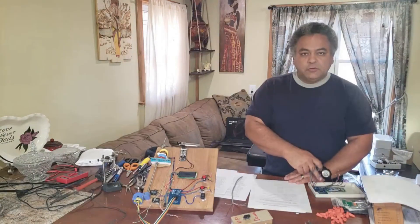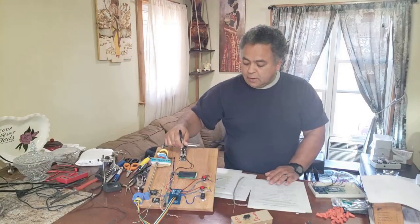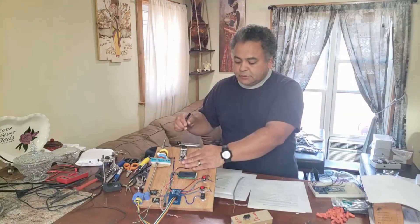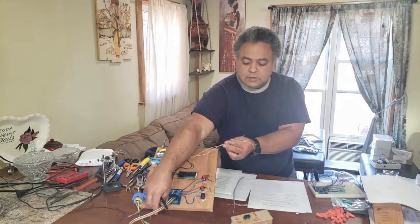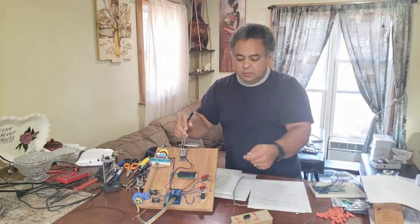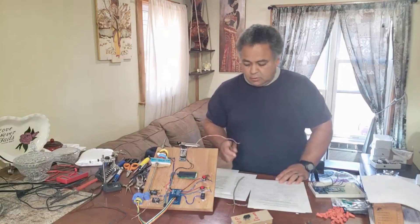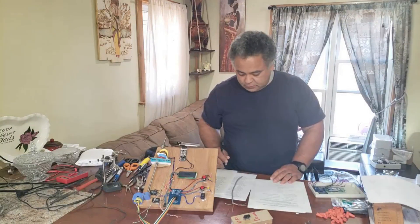This will be very important later on when you're trying to wire it up into the interface board. Once you run this wire, go ahead and connect them — again, the backup on top uses the orange pair on the normally closed switch. For this demonstration, a separate set of wires is being used for each connection simply to show the installation, as the unit is already wired up for testing. We're going to manually hook this up using the test board, and then move on to the next stage of the installation.